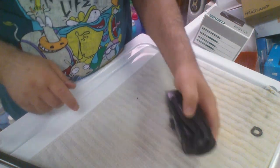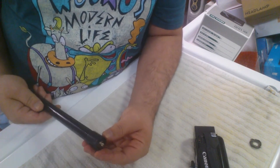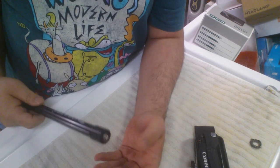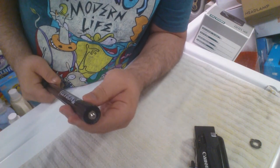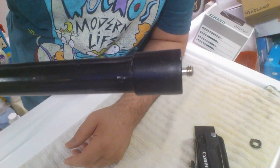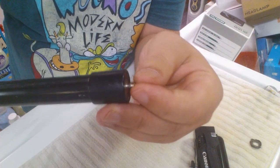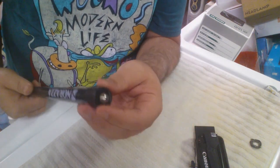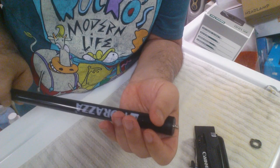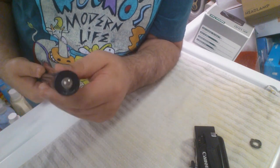Another thing along the way that was important is I said, well, if the washer on the monopod failed, I could put something new on there. And I tried various different things, a couple different O-rings of different sizes and stuff like that. Nothing would work. It turns out that you have to get just the right thickness, because if you look at this closely, see how long that is? Just the threaded part, not the rest. And the washer that was on here was taking up the bulk of that space, so it could only screw down so far into the camera. So what happened over the years of my owning this is that washer finally became thin enough that when I put this back on, I over-tightened it, and that's what cracked it. So that's how it happened.